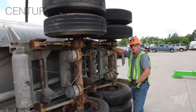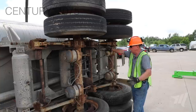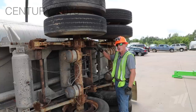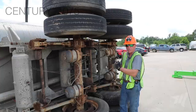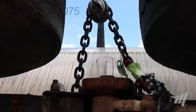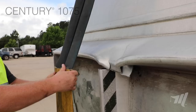Now we're coming back to the rear. What we want to do is use the actual suspension of the vehicle itself. We want to chain the suspension into the track system, just to make sure your hardware is staying tight. We're going to take one 20-foot half-inch alloy chain and make a loop around the suspension after checking all our hardware, keeping that chain very short. The main thing is we do not want the hardware getting into that stainless steel wrap of the tank for any reason — just don't need to cause damage. That strap is going to be short-chained up there, and again we're going to use that fire hose to protect it because we don't know what's going to be sharp on the other end.